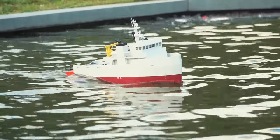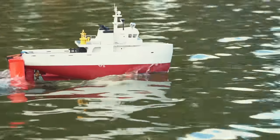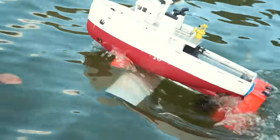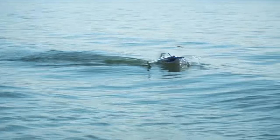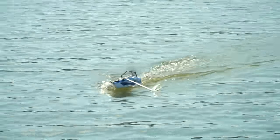So that tugboat actually ended up having roll control in the form of elevons and also rudder, so it's basically like a straight up airplane underwater that ended up flying around. So lessons learned from this, if you guys ultimately decide to build your own hydrofoil, pick a light, fast boat and try to actually get full control of the foils, because it's a lot more fun when you can roll the boat, and you can also pitch the boat and yaw the boat, because it's just like flying an RC airplane, but you're on water and limited to staying within water.